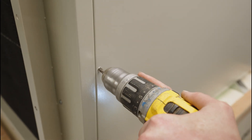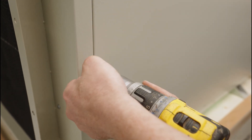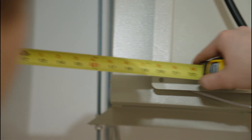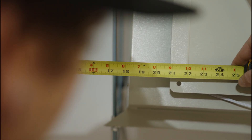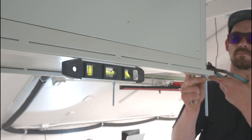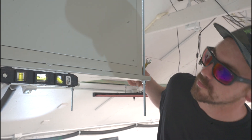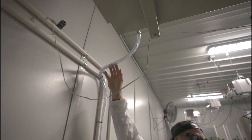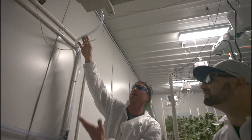Also, because these units are maintained by removing service panels, keep the units a minimum of 18 inches away from the wall so they can be conveniently accessed by a technician. Once installed, make sure your unit is level so that the unit drains properly. To set up the drain, simply plumb it at a downhill pitch until you reach the drain.